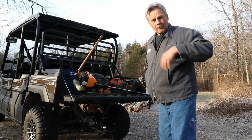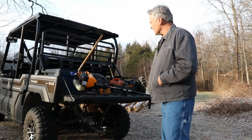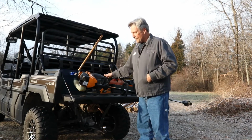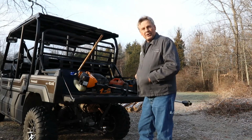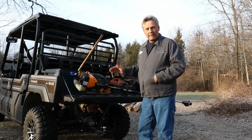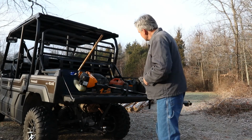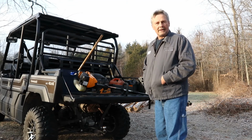Now, in the past 3 or 4 years that has changed, and we've had some other stores open up who carry different brands and things like that. So my options have gotten better. But on the other side of that, I won't take anything away from the amount of work that I've got out of both the chainsaw and the pole saw. I've never had any trouble out of them. I always use premium gas when I'm mixing my chainsaw oil, as well as premium in the mule, my lawnmowers and things like that. So I don't have a problem with the fuel going bad. That may be a pointer for you. 93 octane, and mix this stuff up and it lasts over a year in the gas can.